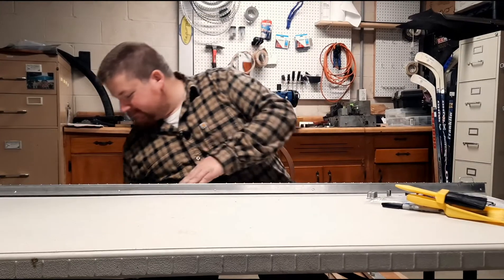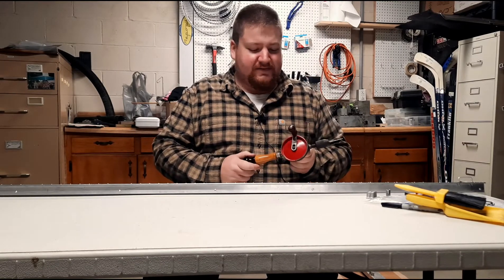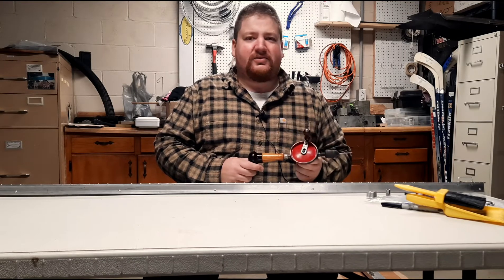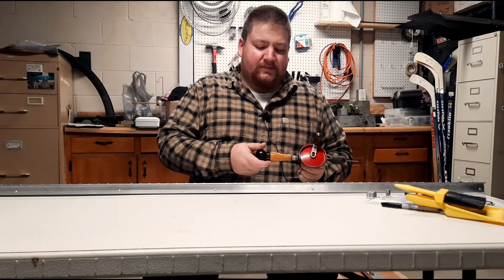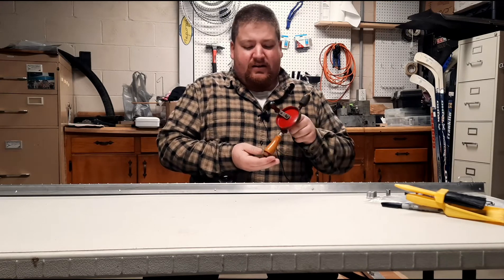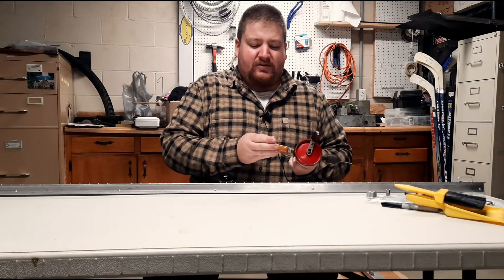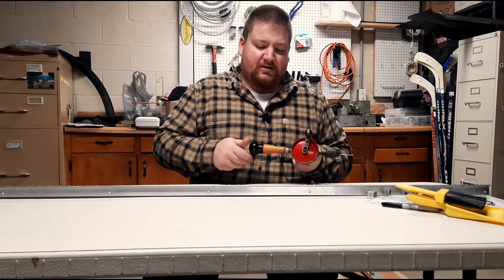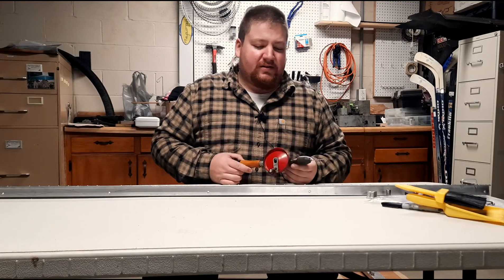So let me grab my cordless drill. It is cordless. If you're on a construction site and somebody asks for a cordless drill and you hand them one of these, you'll get some interesting looks. Nevertheless, these old tools can be a joy to use, and I've actually snapped fewer of these fine drill bits using this tool than a modern power tool. These old handheld drills — typically the end of the handle screws off and they should be full of a variety of old-school drill bits. Something to consider when using one of these is to make sure you are cranking the handle in the correct direction — clockwise — so that the drill bit rotates clockwise. They only cut in one direction, so that's something to be aware of.